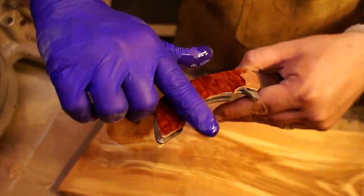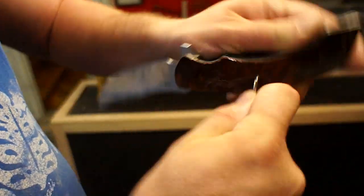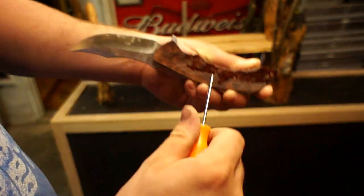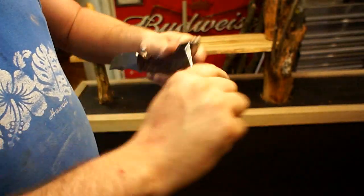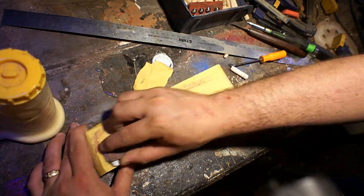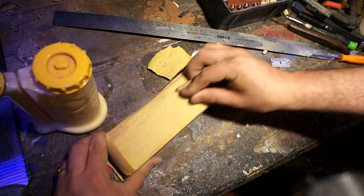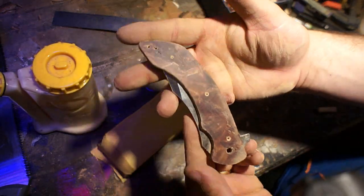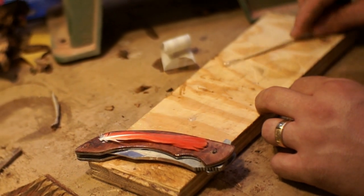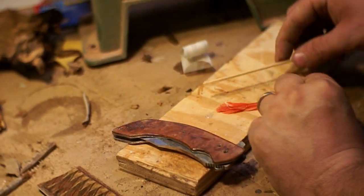Right here I'm coming in and putting some different two-part epoxy — this is one that's more useful for composites and things like that. I really want to make the grain pop. Coming back in, drilling through the holes, cleaning all that epoxy out of them so I can thread stuff into them, and then flattening out the whole thing. After I had it nice and flat I put a test finish on it, and the grain really wasn't popping like I wanted. It was okay but there wasn't really anything grabbing me, so I decided to try some experimenting.